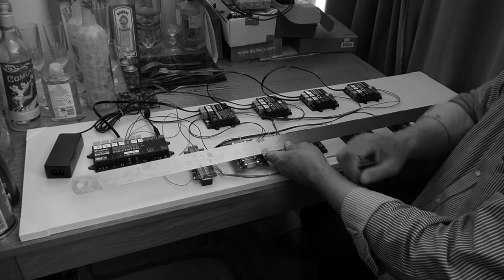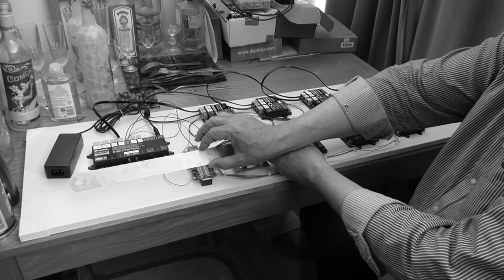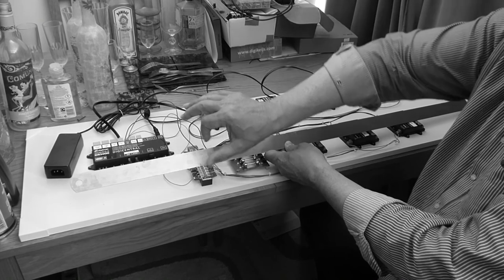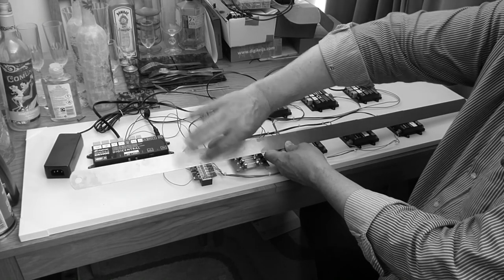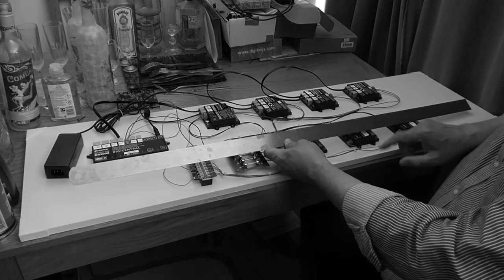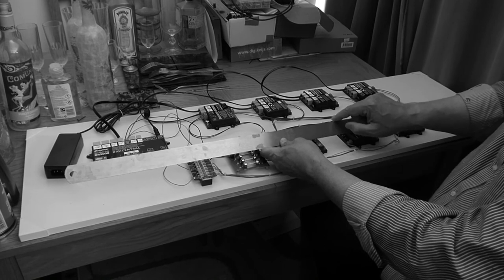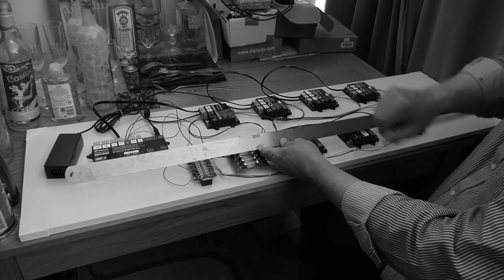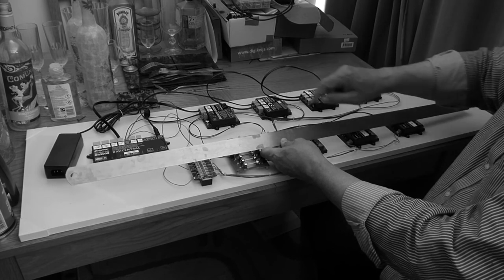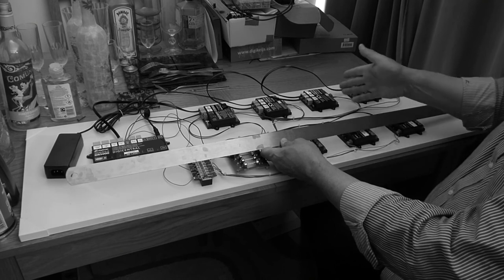Now my thought is, if this unit is switching the polarity from here, the train comes in and it switches round. Another train comes out and it switches round the other way. Now with that polarity switching backwards and forwards, and this is a loop, will it affect the whole loop? If it does, that means that these red wires then become the common wires and the black wires become the feed wires to the detection, which is no good because they don't actually feed back to the detection unit, so the system won't see where the train is. And will it cause damage to the units?